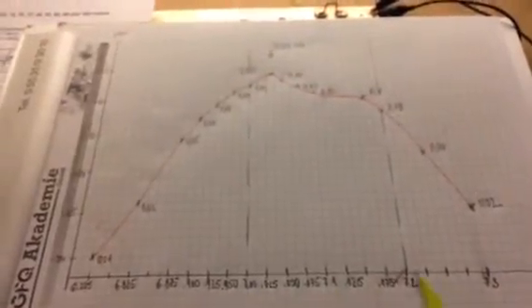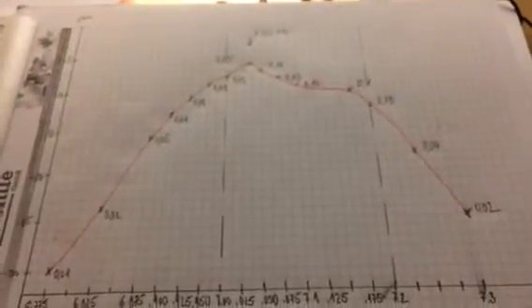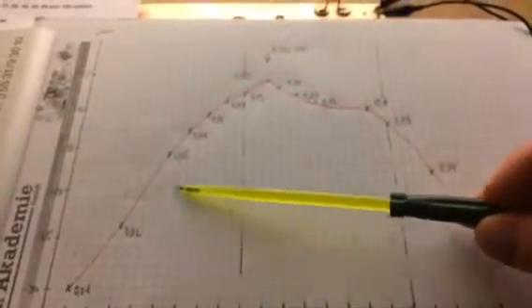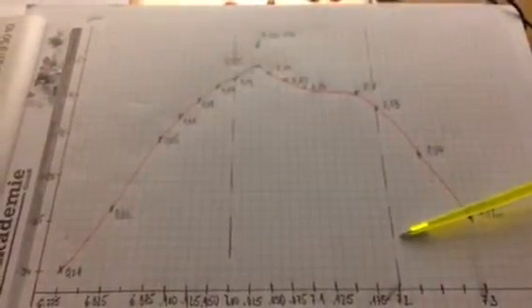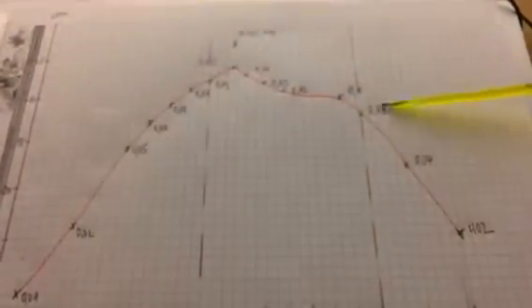To see if everything works fine, I took all the numbers and came up with this chart here. We got the frequency on the bottom axis and dBm on the Y scale. I transformed the roughly measured volt effective values from the oscilloscope into this plot. What we see is the rejection — this is the 7 megahertz line, this is the 7.2 megahertz border. As described in the W8DIZ manual, we got about 6 dB bandwidth of about 140 kilohertz at 7 megahertz.